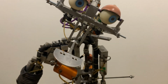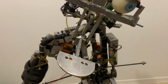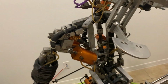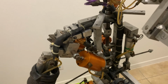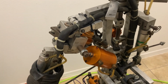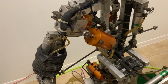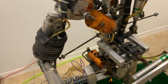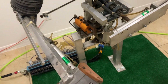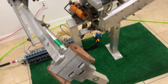I started by removing the outer fiberglass body shells and began cleaning the character frame. I used acetone to remove grease from all the little crevices with a toothbrush. Acetone is basically just a solvent that can dissolve grease on contact. The drawback is it's kind of a caustic chemical, so you need to wear heavy gloves, otherwise it will damage your skin, and also make sure you're in a well-ventilated area when you're using acetone. It's basically like a high-power version of nail polish remover.